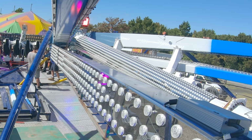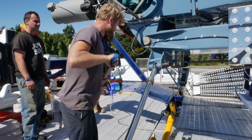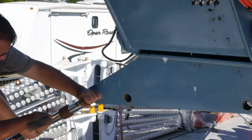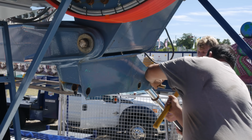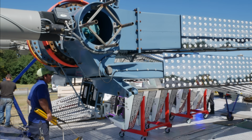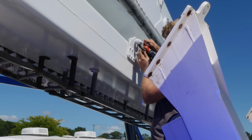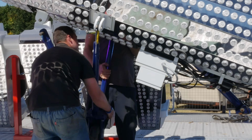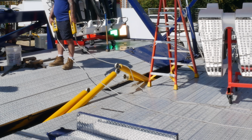The hydraulic cylinders that lift the tower can be maneuvered to help take the pressure off these lower cylinders to aid their removal. Before the tower is lifted, some snatch blocks are installed, which will be used later during the assembly. As the tower begins to lift, the landing gear can be taken off the swing arm. Those yellow struts will eventually be removed and the openings covered with decking.